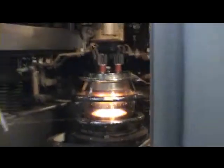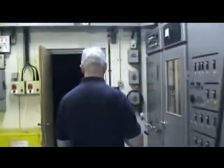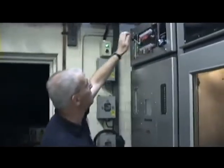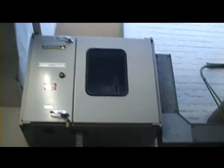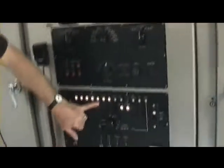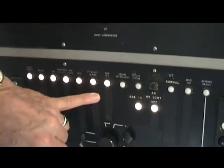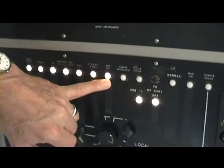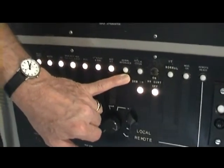We'll shut this back up again so we can continue the power-up. Earths off, motorised isolator shut, power supply on. We've now got the fills on. The first AF, HT and BIAS is on — that's those TT21 tubes, they've got supply. The AUX HT is on and we're ready. We haven't got an antenna on this one yet, so we can't progress any further until we do that. We'll go away and sort that in a moment and then we'll have it on the air.